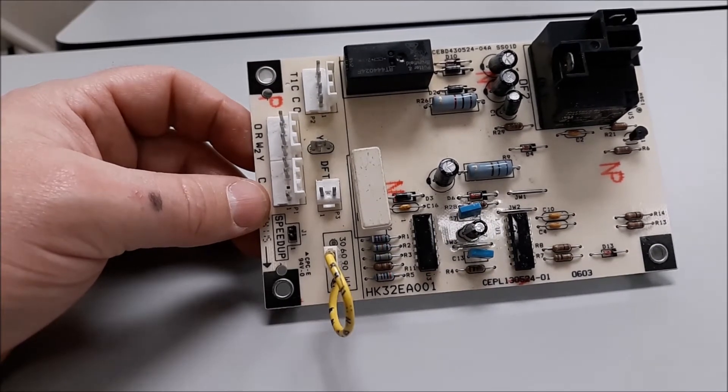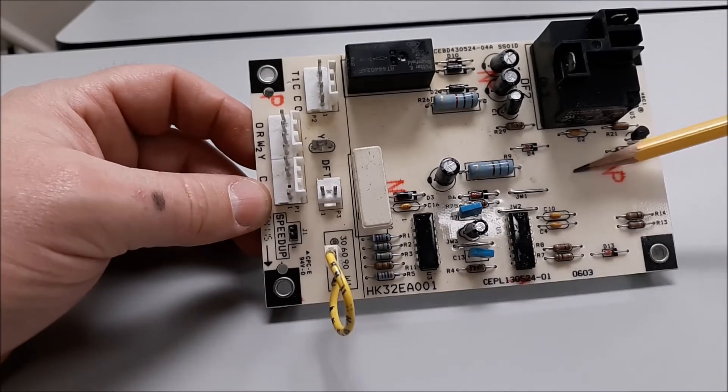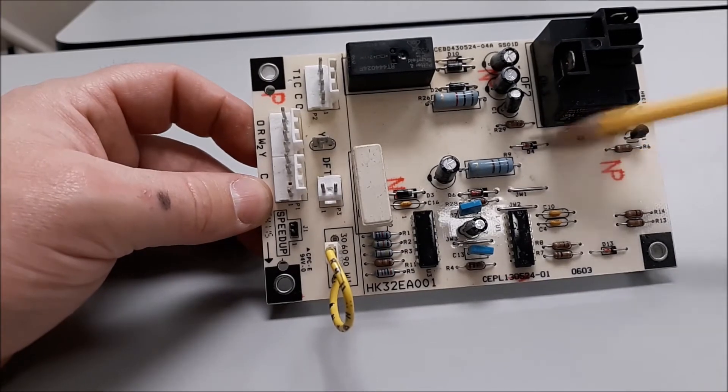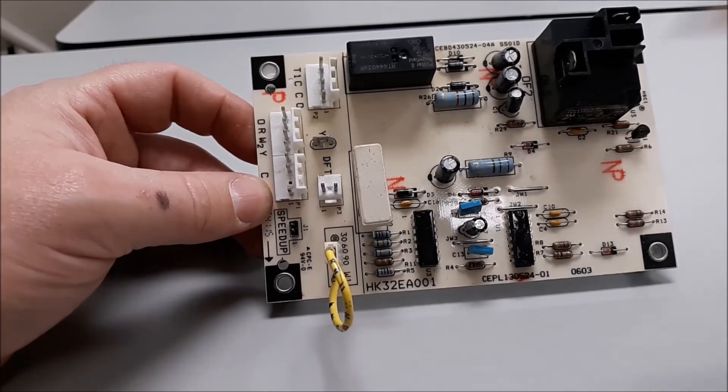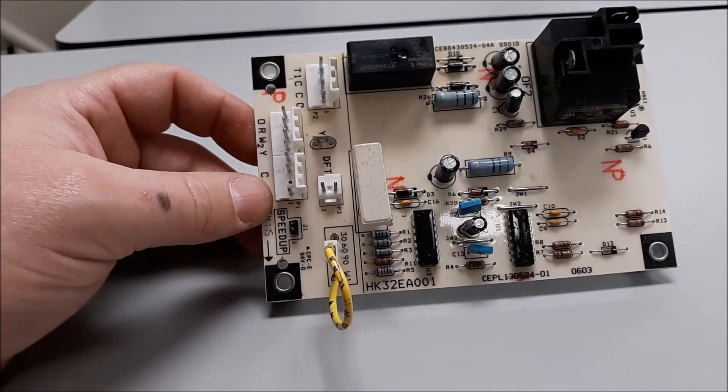Cumulative time — so 10 minutes here, 10 minutes there, 10 minutes to complete the 30 — that's fine. Time or temperature will take us out. What time? Maximum 10-minute defrost cycle. If it's not thawed out by then, we'll just do another defrost cycle in 30 minutes. What temperature? The coil temperature. That same switch on the DFT that put us into defrost will take us out once the coil temperature gets warm enough.